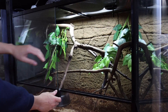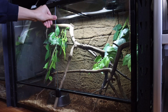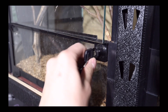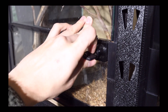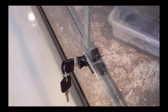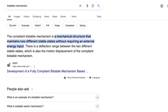It sounds like a minor problem, but it got really annoying as I'm usually holding food or a spray bottle when I'm opening these doors. Instead of a spring-loaded latch design, I wanted the new version to have a latch with an on and off position. The original lock's key was very frustrating to use, and the way the latch slowly comes up as you turn the key is also quite annoying. So I made it a point that the new lock must have a latch that toggles between the locked and unlocked positions quickly and easily.